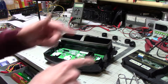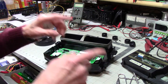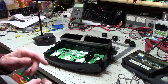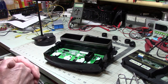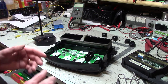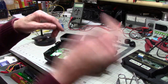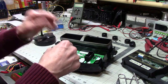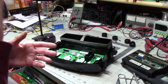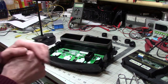So you actually have three steps in this process. You've got your ignition switch, which is a low current. You've got a relay, which is higher current. Then you've got the solenoid in the starter, which is even higher current. So in that scenario, you've got three different stages of size connectors that are doing different things to make that function. And in a lot of GMs, the ignition switch actually is connected directly to the solenoid. So you've got this small wire going down to the solenoid, and this big switch inside the starter, which makes it work. In that case, the heavy-duty wires just go from the battery to the starter, and all that heavy-duty current is handled by the starter itself.